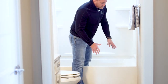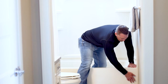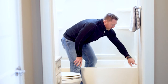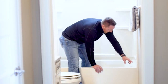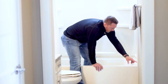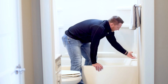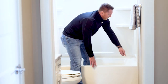If you ever suspect or see any areas that might appear suspicious — where the paint has kind of bubbled or the trim board is losing its paint — you want to check for a maintenance item, and that's just making sure this four-inch strip on the edge of the tub is sealed with caulking. Where that little drip drain is, you don't want to have it completely filled with caulking, but you want to have some caulking in there, and that allows moisture or water in the channels to funnel out and at last resort drain right to the edge of the tub.